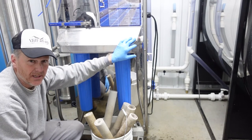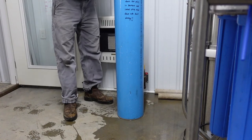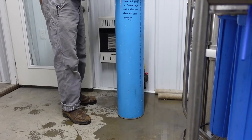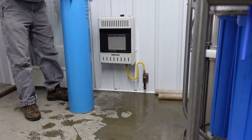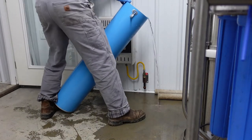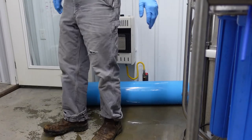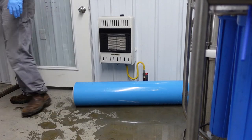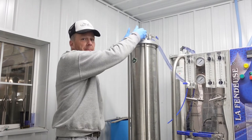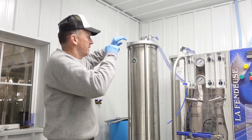We're going to pull it out and hopefully that will solve our problem, allowing us to push the brix or sugar content even higher. Overnight we put our filter in permeate — permeate is water that we make here on the farm as a result of our reverse osmosis process. When water is split, the sugar and minerals go into our tank and that's what we make maple syrup out of, and the other part is used for cleaning. By putting that membrane in permeate overnight, it has hydrated it enough so that we can install it and begin using it right away. We've got to take off these four screws, pop the top, lay it on its side, pull the membrane out, put the new membrane back in, and do everything in reverse.